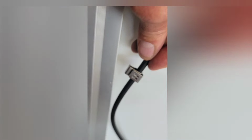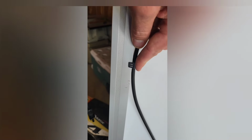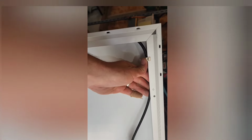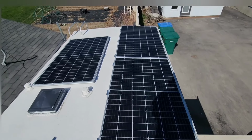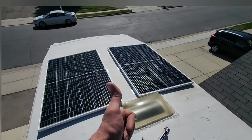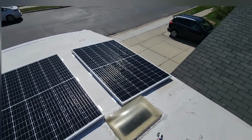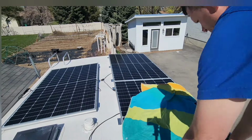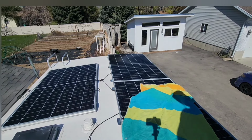I was able to find these awesome clips, which clipped my wires onto my solar panels so they wouldn't flap in the wind. I really like these. I'll put a link to all these items in the description. Next, I set my solar panels on the roof without screwing them down in the exact spot I wanted them, and I marked all of the brackets with a pen so I knew where they were gonna end up after I screwed them down.